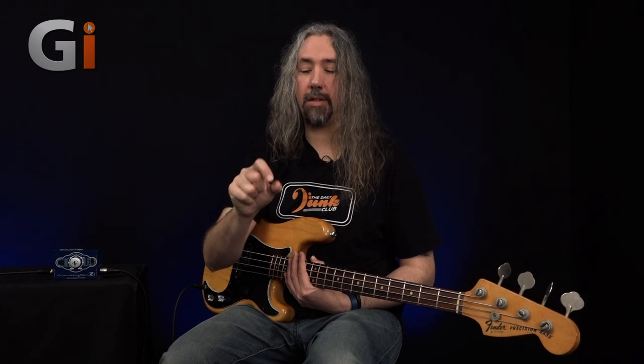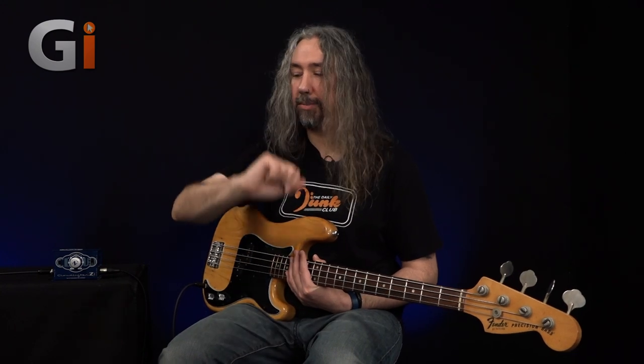For some recording devices, maybe the preamplifier on the device itself doesn't like being cranked up — it introduces noise. So Cloudlifter have gone: why don't we use a dead-silent preamplifier and boost the signal at source, rather than having to turn up the gain on the recording device and introduce hiss and noise? Big tick in the box straight away.